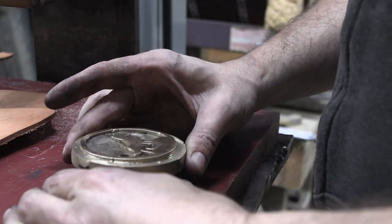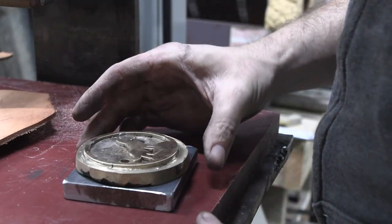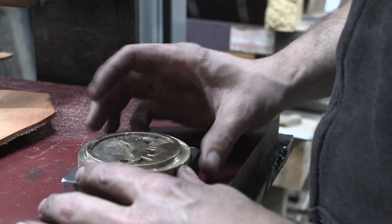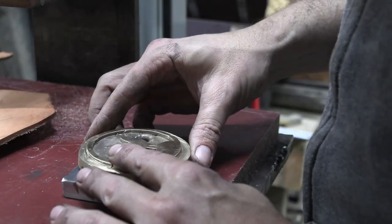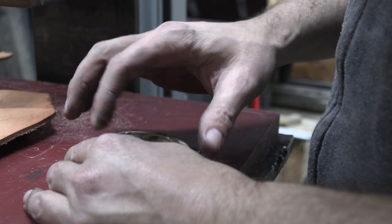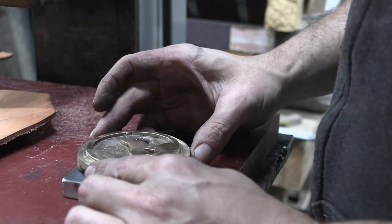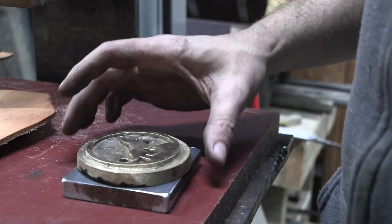Okay, now I'm going to attach this to a block of steel so we can weld handles or fixtures onto it, or whatever somebody wants to do, and add some durability. I'm not entirely sure people aren't going to use this as a brand as well, because I'm making this for someone else. I don't know exactly what their plans are. But anyway, I had this casting void in it and I drilled a hole down through that, and I'm going to drill and tap this metal plate and screw it down onto those. I've also drilled another hole over here, and I'm going to countersink that one down a good bit so the screws are about even. Then I'll use those to mark the holes in the metal block and get it all drilled, tapped, and put together.